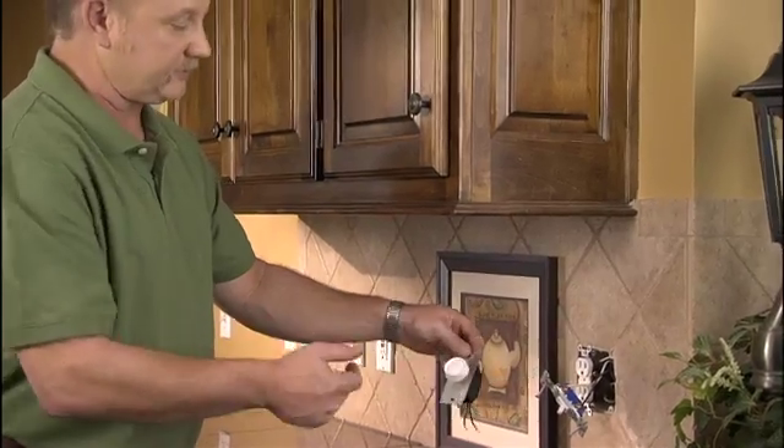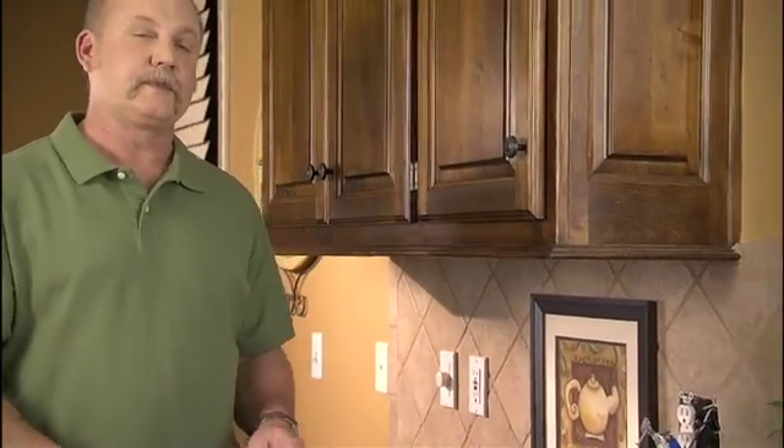Install the dimmer back into the box, put your cover plate back on, and now you'll have control over your lighting. If for some reason you go downstairs, turn your circuit breaker back on, come up to test the outlet you just installed, and it doesn't work — go back and double check your terminals. Make sure the wires you've installed are tight and in the proper location, and that any wire nuts or other connections in that box are also connected and tight. Once you've double checked all of your connections, turn the circuit breaker back on and check your outlet — you should be fine.